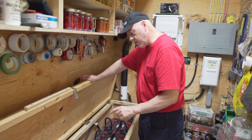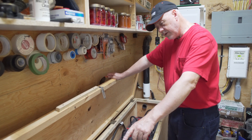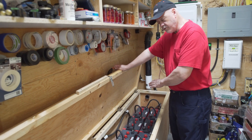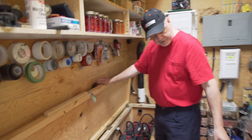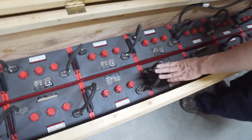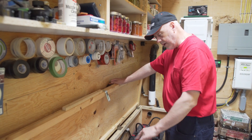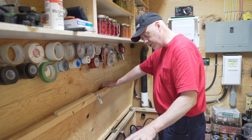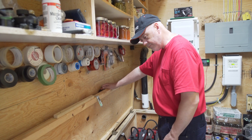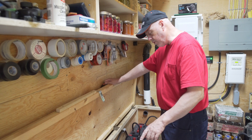But I really wish now that I had gone with a single string of bigger batteries, because it's hard to keep both sides balanced. If one battery bank is weaker than the other, the stronger one will do all the work. I have a multimeter down there — you've got to get one that'll check DC — and you can put it around your wires to tell you how much amperage they're drawing. This set of batteries does about two-thirds of the work compared to the other one and always takes more water. I've checked all my resistances, all the voltage, everything you can do to try and figure it out, and I still end up with this imbalance. It would just be more efficient if it was a single bank.